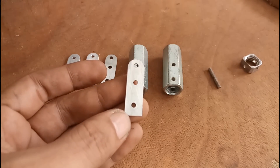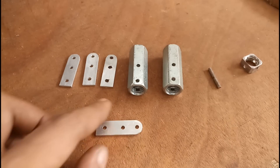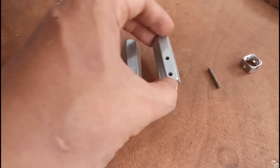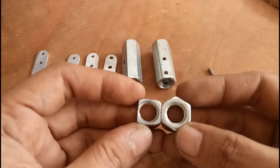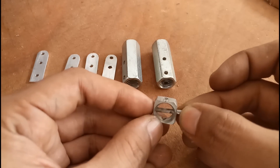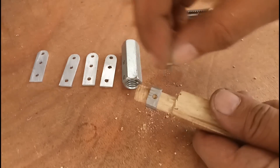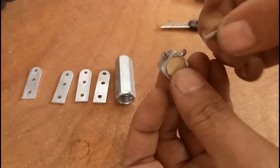These are the parts for the universal joint. I cut the flat bar lengthwise in halves, drilled 3 holes — 2 holes are to be attached with long nuts. That's going to be the yoke or fork, then I rounded over one end of this piece. This assembly was not in the plans — it was one of my last-minute decisions, done on the fly, but it's pretty easy. This is the nut that I filed into a square shape, though making it round would be even better. I found insert pins — I insert this long pin and 2 shorter ones to use as the cross pin of the universal joint. I drive the wood until it's tight, then cut it off. Here I've inserted the long pins and added the smaller pins, which function as the cross pin. I epoxy-glued them in place.